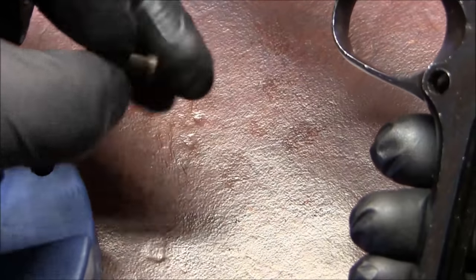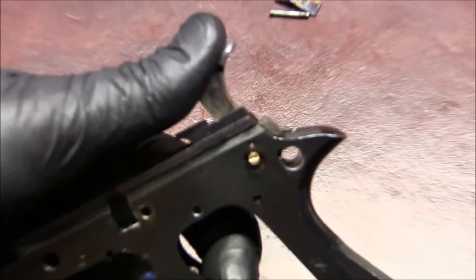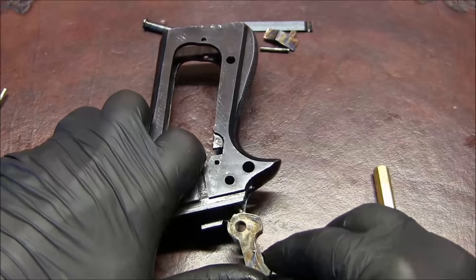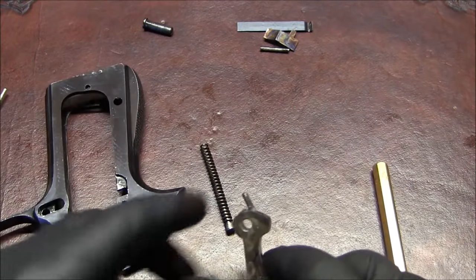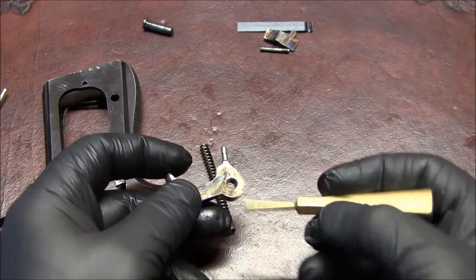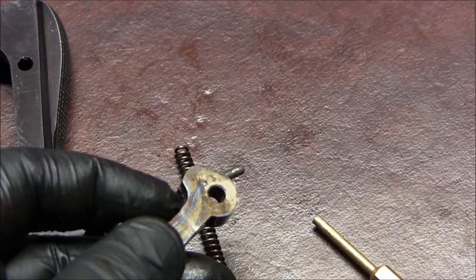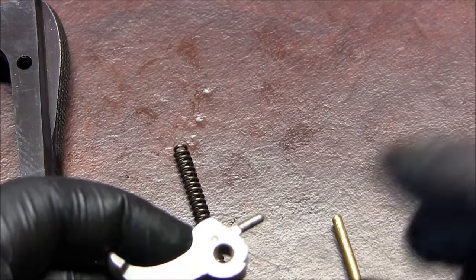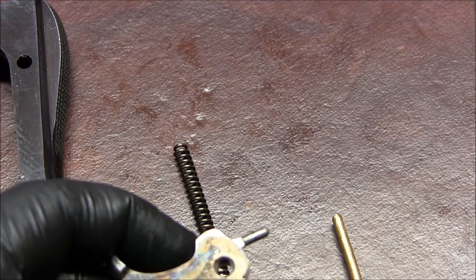While holding the hammer, I'll take my punch out and allow it to come out slowly, followed by its plunger spring. It also has a little strut. I took the strut out before just to clean inside — there's one pin in it. That tiny little pin is expanded on both sides, so pick a side, use a smaller punch, and give it one good whack of a hammer and it should come out.